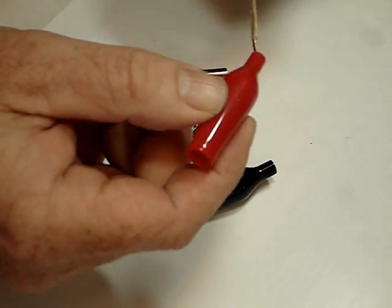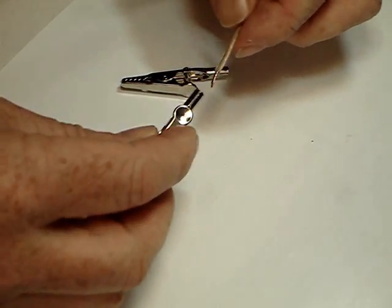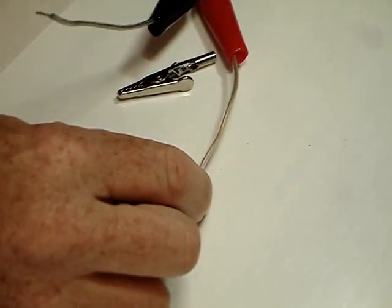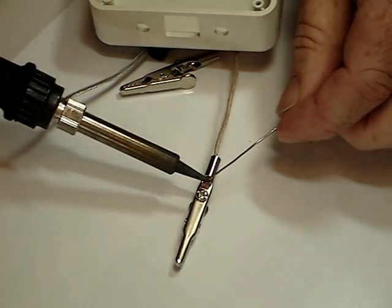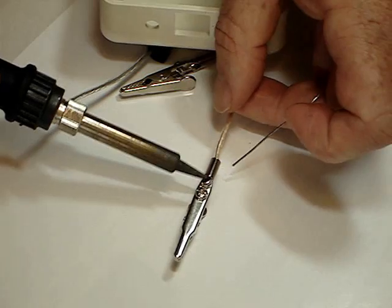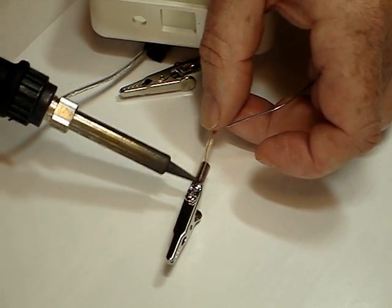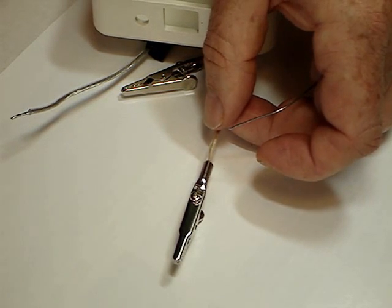The red is the positive — it goes on the wire identified as the red wire, in this case the one with the copper conductors. Put both insulators on and push them through. Bend the wires up a little bit and push them in so you can see the wire at the top of the alligator clip. Now get your solder. Because this is a large piece of metal, it'll take a little while to heat it up, so just push some solder on there and let it transfer the heat, and once it's nice and flowing put some more on.